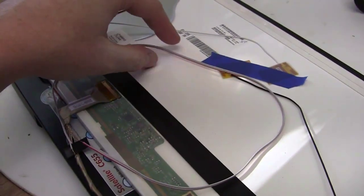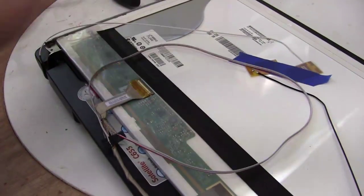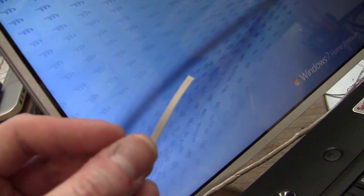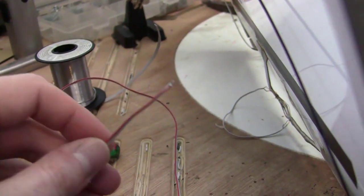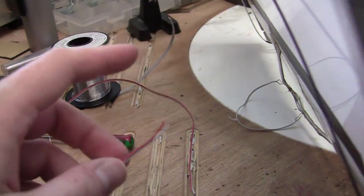There are the redone connections — here is the twisted pair represented as a long piece of ribbon cable. This is longer than we'd need, so let's test it. We seem to have lost image. Now it's working. What we did differently was use some thin solid strand cabling, such as you would find on an Ultra ATA hard drive. You have to use the thin wire. Quite often, if you try to rewire high-speed devices with stranded thicker ribbon cable like what we tried first, it won't work.